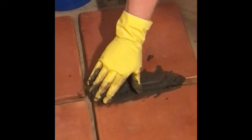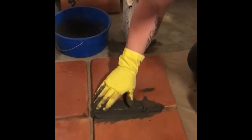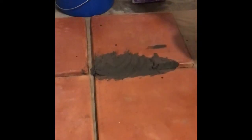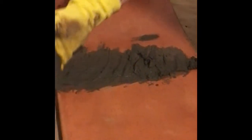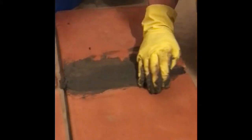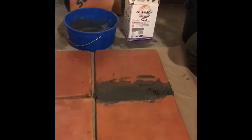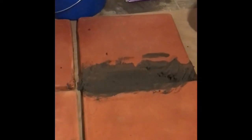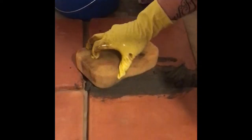Things to consider when you're doing Saltillos while you're grouting: even though I got these tiles all flushed down, this tile right here is obviously sitting up a little higher because it's warped and a little fatter. Usually I use a float but I'm just doing it by hand real quick. So you can see I put in the gray here — this is natural gray. This is probably the most common color on every job we do.